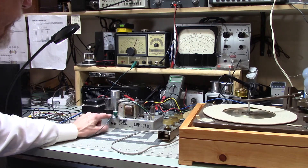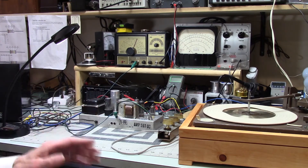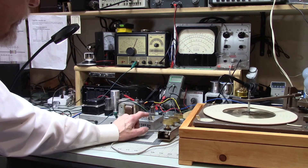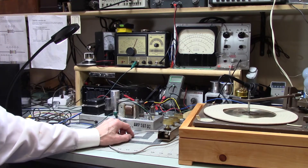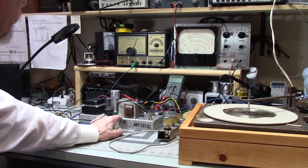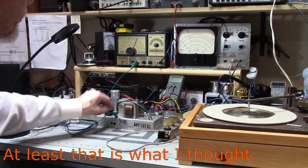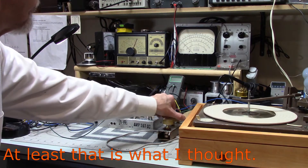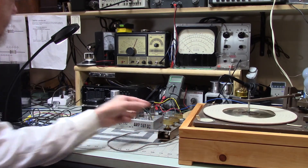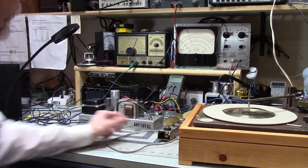So apparently — and I have no idea how this was mounted originally — I can't find any information on this. Given the way they did things back then, I highly doubt they were relying on more than the ground coming in through these two connections. These grounds are grounded to the chassis. So what I'm going to do is put a three-wire power cord on this — and that's going to solve my humming and static.